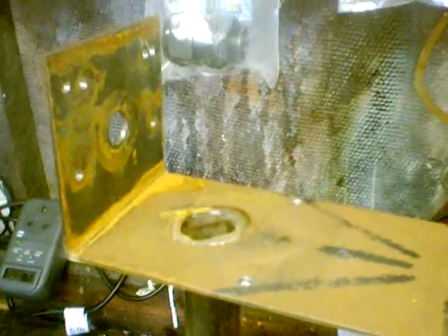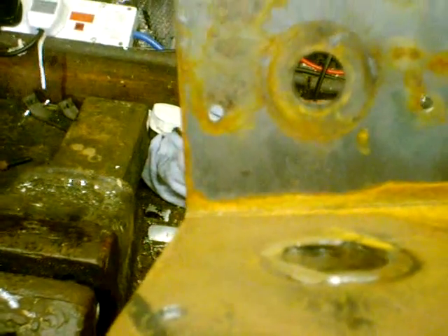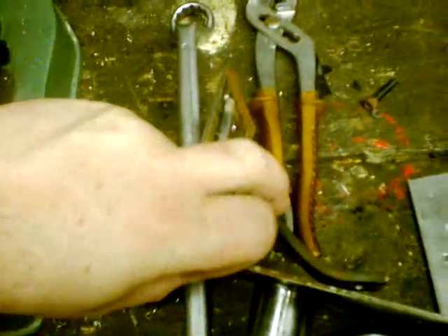This is my first attempt at a wind turbine mount — of steel — and it was actually going through into the 50mm tube with some copper-impregnated bushes. Not very good. After so many months, the welding which was done by a friend of mine started to snap — you can probably see it on the edge there, it just started to come away. It wasn't strong enough, and the plate I used was too thin. I reinforced it with some brackets, which did give some extra strength, but to be honest that was pretty crap. You live and learn.